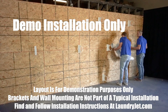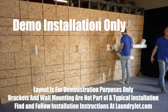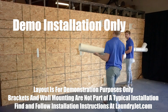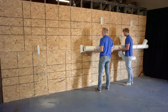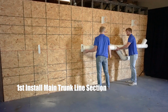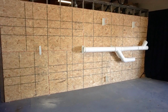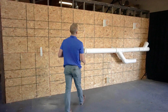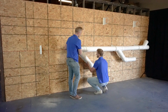It's important to note that before laying out your pipe installation assembly, you should find the longest run sections available in your assembly area so that you can run your trunk line and have all other lines lead to and through that pre-installed trunk line system. That trunk line is typically a rigid set of pipes that are then connected into through Ys.